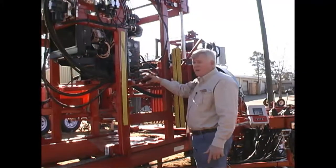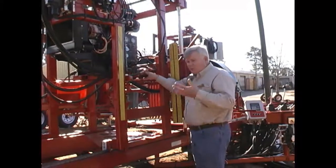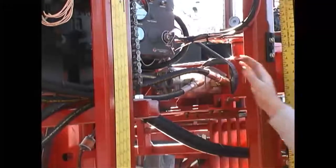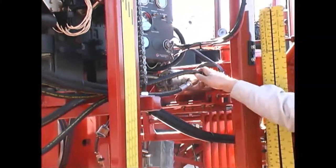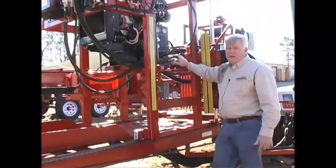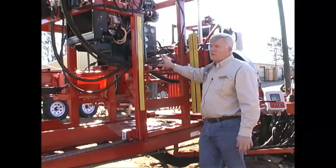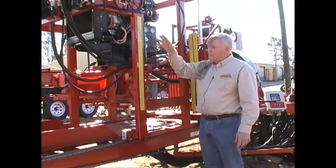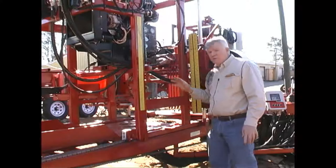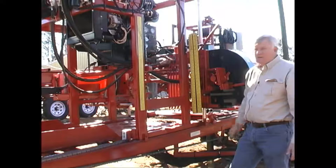While at the pump - this is a two-stage pump. We have a two-stage pump on mills that have the debarker, or mud saw as we call it. They're separated so we can run the mud saw without interfering with our forward motion at all. With this system we turn the pump slower than its high volume capacity - we run it slow, which keeps the oil cool. We have a tank up there with sufficient oil; it doesn't run hot and does a very good job. Every movable function on this mill is done with hydraulics, which is very durable and holds up really well.